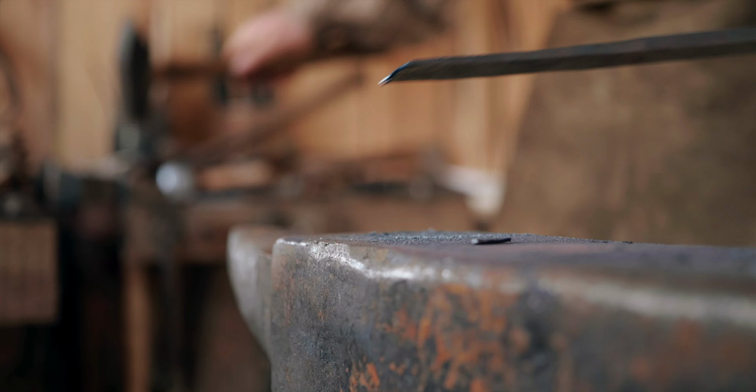So I'm actually on the third attempt on this bolt. Screwed it up twice this morning. This was the second attempt, and I got this area too thin, tried to upset it. Almost fixed it, and then cracked it right here at this transition, which I was afraid of, but that's okay, because on this third attempt, I'm able to do things that I learned on the first two. But this is going to be very cool if it works properly.